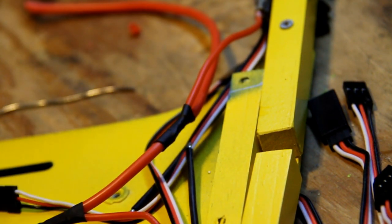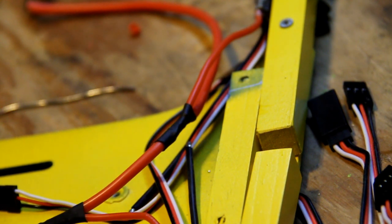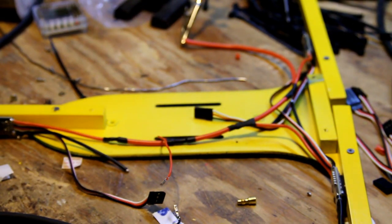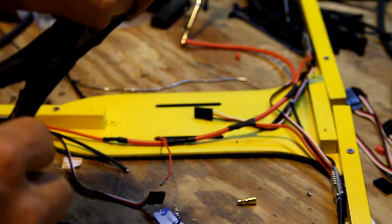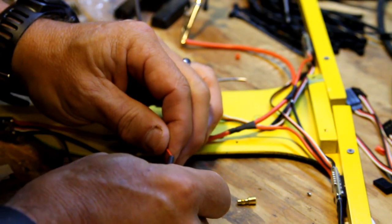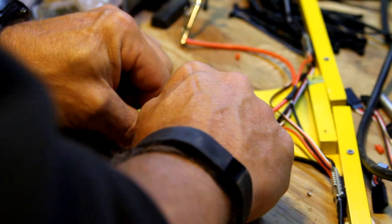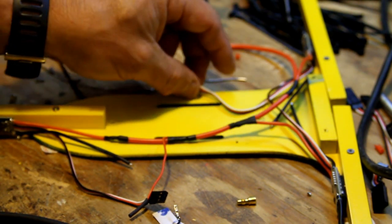So if you've got 20 minutes in the wiring harness if you're really good, or 45 minutes if you're not — no big deal. We're going to do the black wire next — just like the positive except you won't need the little battery voltage tag wire. Also there's something you need three mil heat shrink for — put a little piece of three mil on this particular piece right here. That will save your board from blowing up in a really nasty crash. Just do it while you're thinking about it. Now we're going to run the negative the same way, and when we're done we'll zip tie around here to hold all this stuff inside so it won't flop out during fast rolls.